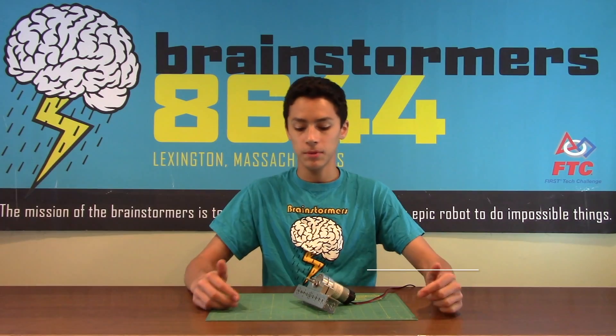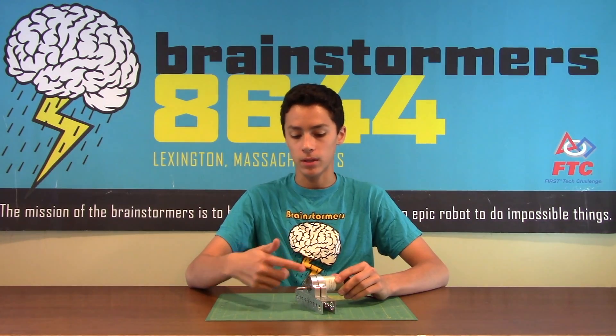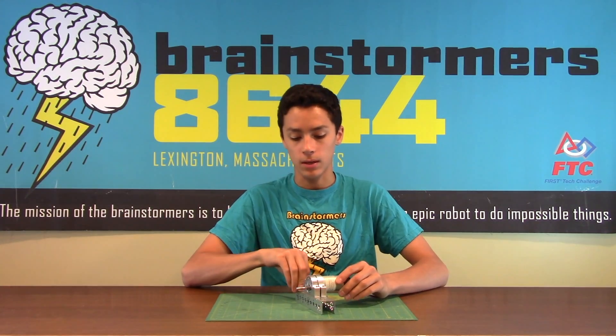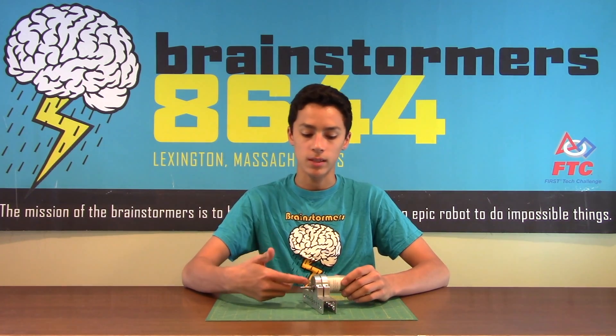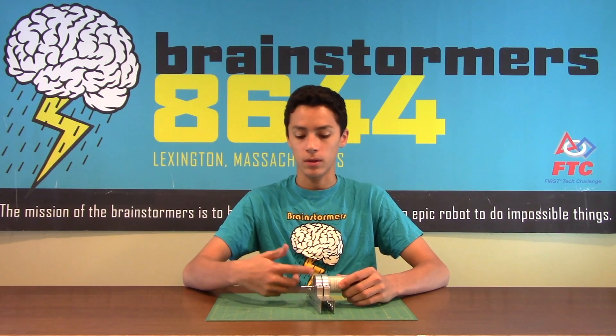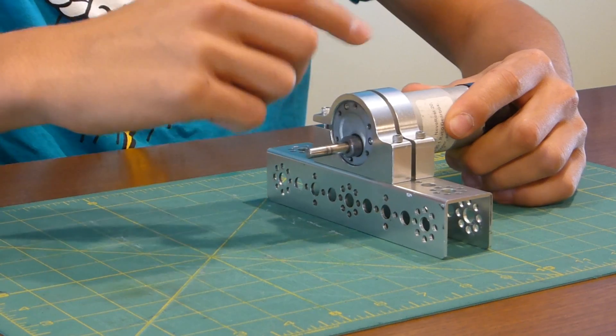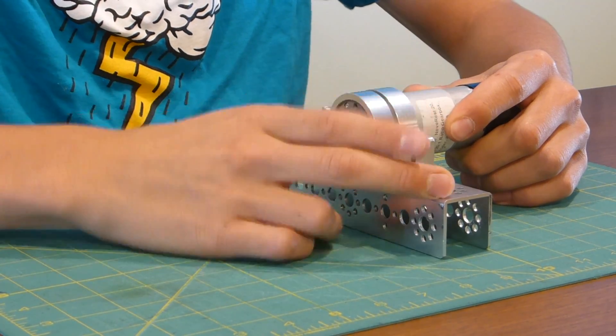On the concept of flexing beams, the Tetrix motor mounts are secured at one point on either side, which allows the motor to really move around quite a bit. So if you have gearboxes and you're trying to tighten your motor with the offset shaft, you can run into problems where the motor mount is actually flexing. You can simply double up the motor mounts and it creates an incredibly strong motor connection to your beam.